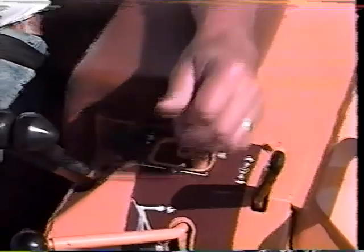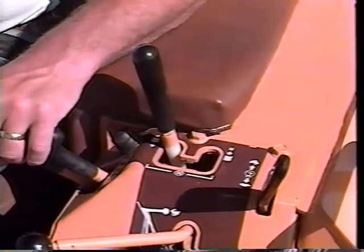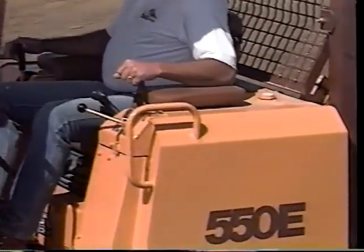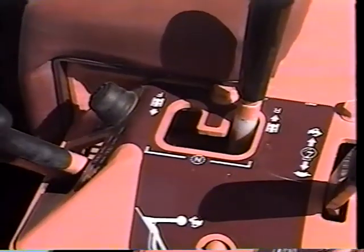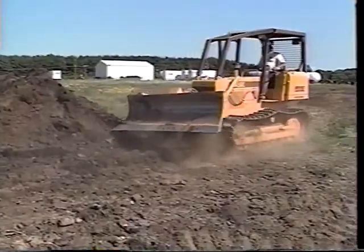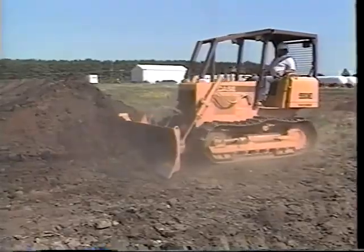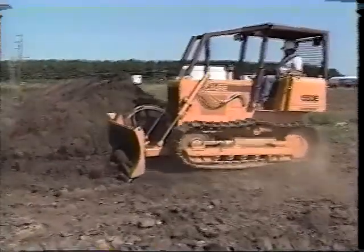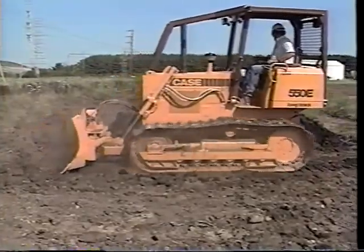The forward reverse lever is standard from the factory in a U pattern, which is the industry standard. The shifting motion of the operator allows him to use a rotating finger and wrist motion from forward to reverse or vice versa. The shifting is very low effort and requires very little movement. A major feature of the shifting is the smooth modulation between forward and reverse. The modulation provides smooth but quick direction changes at any throttle setting.